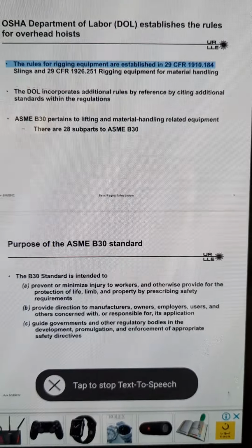Basic Rigging Safety Lecture 10. Rigging equipment must be inspected prior to each use, to ensure that it is safe. Hardware: visually inspect all hardware for damage, including but not limited to screws, lifting shackles, hoist rings/lifting eyes, etc. Look for thread damage, bent or fractured pieces, intentional or unintentional modifications. Slings: visually inspect for damage or fraying. Ensure the load rating tag is on the sling and legible. Inspect sewn threads. Any rigging equipment that is found to be unsafe must be removed from service immediately.